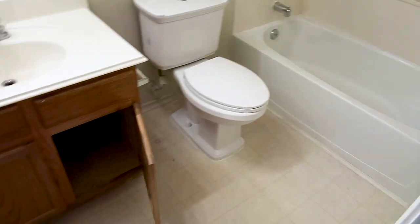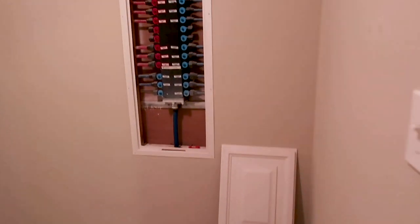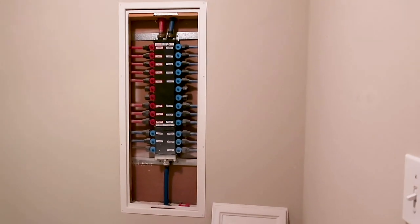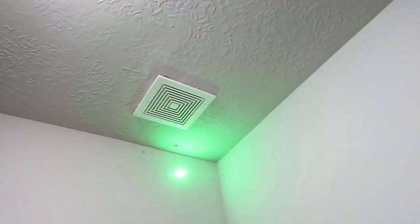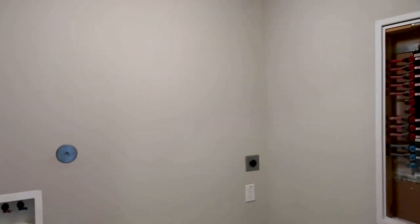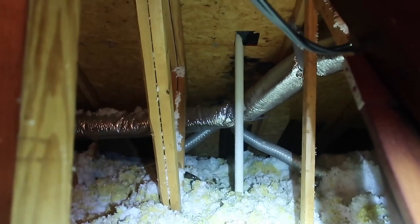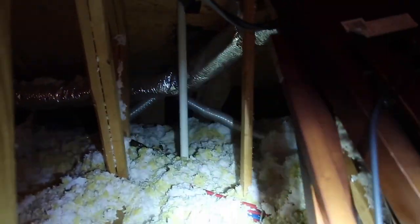For the garage, this isn't really where the water stain is, but water travels in weird paths. I'm going to run the tub, run the sink, and flush the toilet several times. Right over here we have the Pex waterline manifold — that's more likely where the water is coming from. As part of my investigation, I'll run as much water as I can and hit that spot with a moisture meter. Looking closer at the top, there's a water line there too. I initially thought it was the bathrooms or the Pex manifold, then thought it was the AC unit leaking down the wall — but I was wrong. It's actually from a plumbing stack. You can see the water damage coming out of the plumbing stack, running down it and falling into the garage.